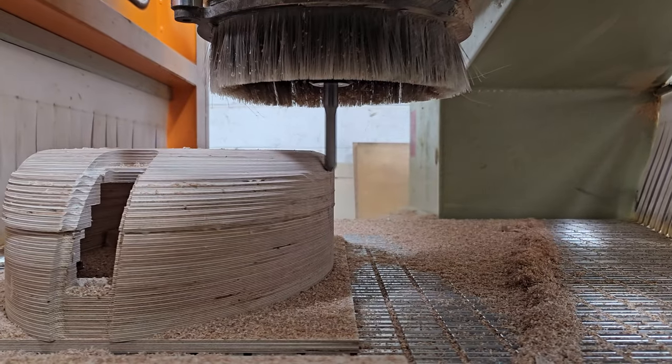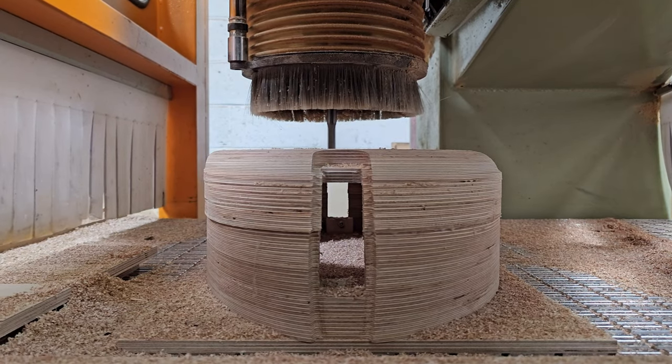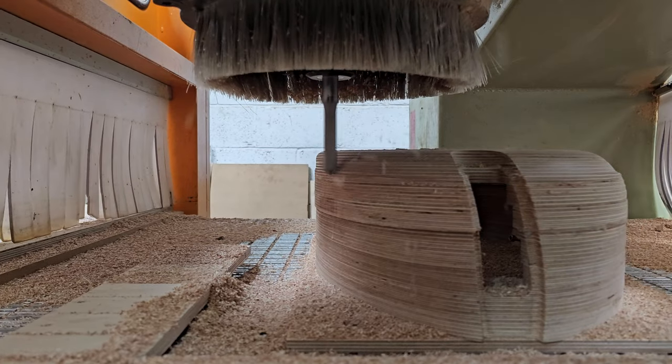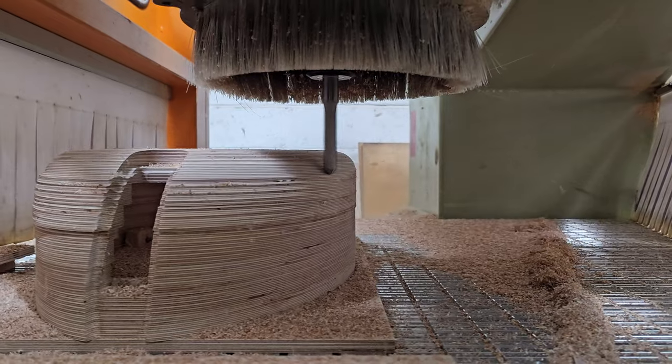The machine's got this fairly neat feature where, in the safe startup block for the G-code, if I put in an M38, it looks for a vacuum check. On the right-hand side of the bed anyway, it looks for a vacuum check. It's an M28 for the left-hand side.